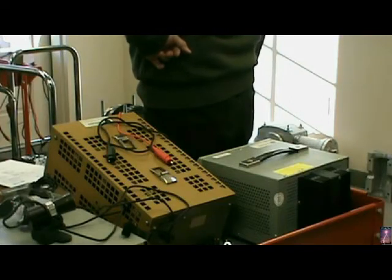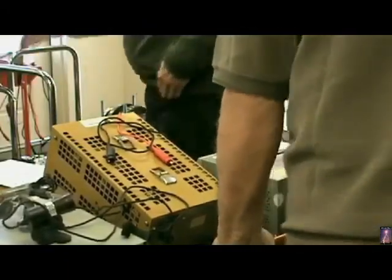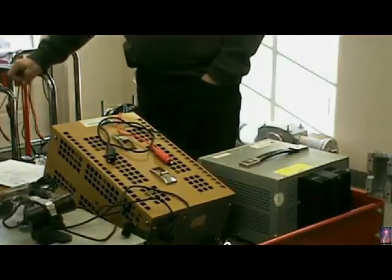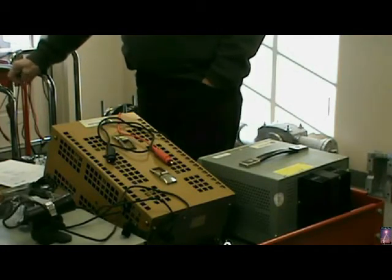You're back to CMOS, you don't use IGBTs? No, we're using IGBTs. What's CMOS? I mean the MOSFET. No, the MOSFETs are used to change the voltage on the coils, because they're an analog device. IGBTs are used in the actuators because we need to switch a very large inductive current, and they were designed to handle that.